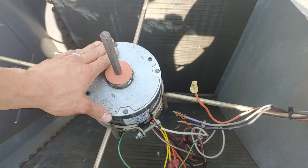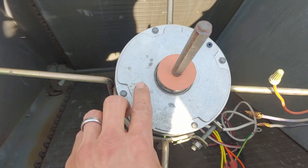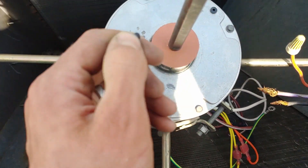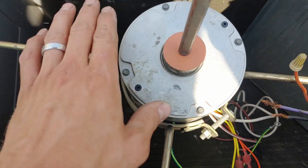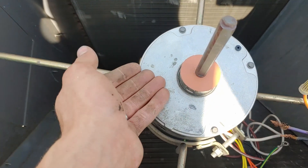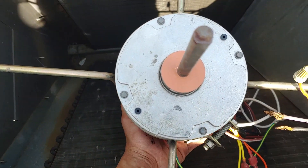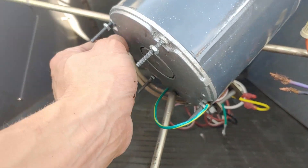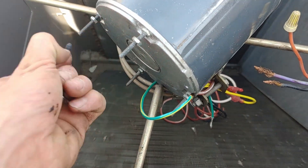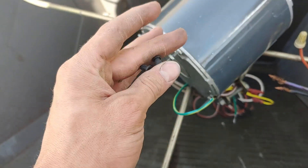When the motor is clamped into the frame like this, the ground is a little bit redundant. On the top of the motor we have these two rubber plugs — you want those on the side of the motor facing up to prevent water from getting in. If there are any plugs on the bottom, make sure you remove them so the motor can drain properly. Since this end of the motor is facing down, we'll pull out these rubber plugs. They used to ship two; now they ship four so each hole is plugged — we don't need those bottom ones.